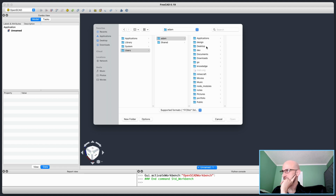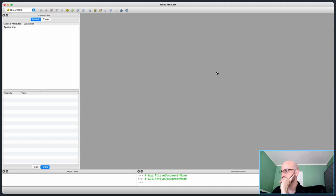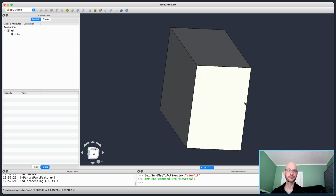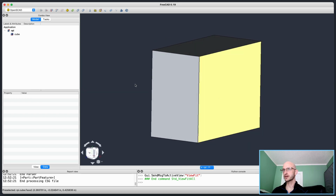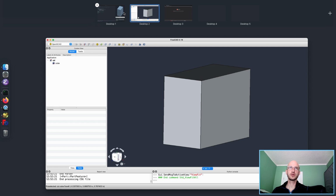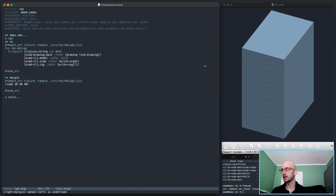Design, here we go. It's doing something. Look at that. Okay, that's extremely promising. And it actually simplifies things just a bit. It doesn't permanently solve every issue. What I mean by this is I do know there are still some incompatibilities between OpenSCAD features and FreeCAD. For example, I think Minkowski's sum isn't done at all or is done differently in FreeCAD, so you get model inconsistencies. However, if I avoid certain features, I think I can get a one-to-one output.